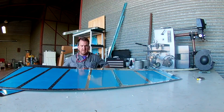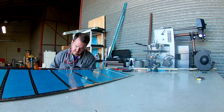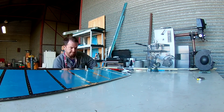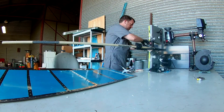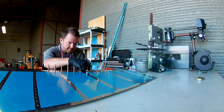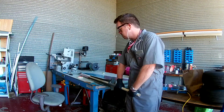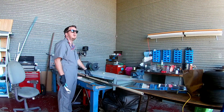If you crack the skin, you're going to have to order all those parts over again. On the left side, I've got my hand seamer in place. Since that's the skin that will be sitting on top of the two pieces when they're folded over, Van's wants you to put a little extra break in the very edge of the skin, just so that it folds over nicely and creates a slightly flatter surface. I like to use a hand seamer for more control, putting a little seam on just the last quarter inch of the metal.